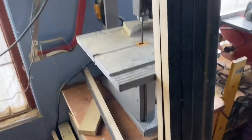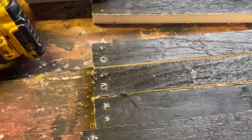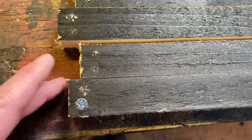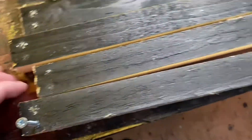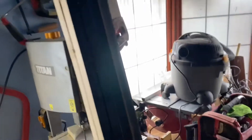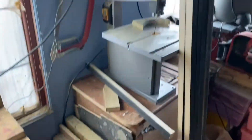Okay, so I've cut all the pieces up now, they're all ready to be made into the doors. Get your measurements right for your door — obviously everybody's door will be a different measurement, so I've got my measurements right. I've done the pilot holes so it doesn't split. I've got the 50mm screws — two inch screws — and that piece sits on top and screws into the long length of the door. I'll be making up four door frames to fit into the area I want, so I'll get on and do that.